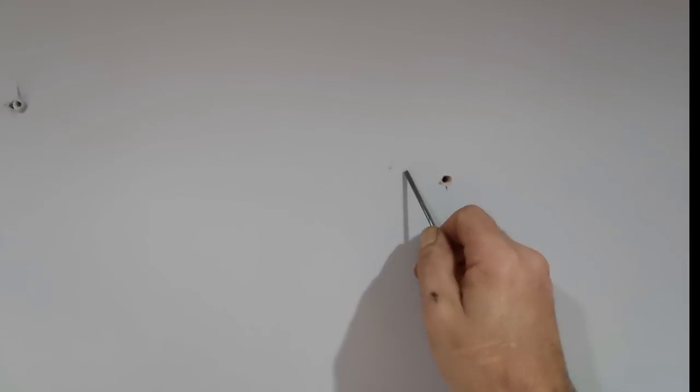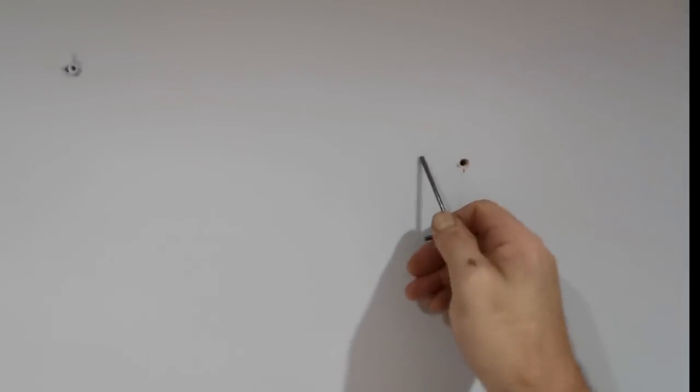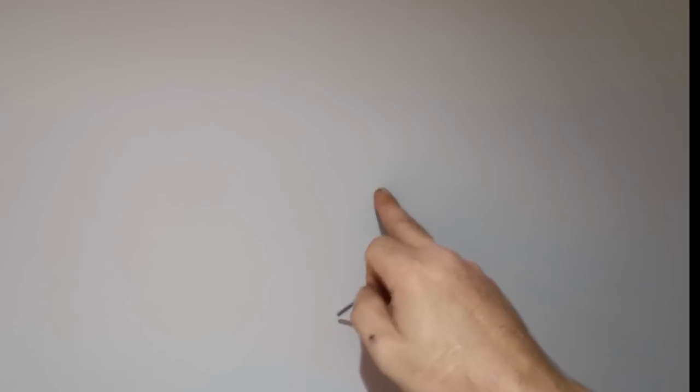So what I'll go is less than 2 inch either side. If you go more than 2 inch, you might miss the stud. We'll see. I only need 1, 2, 3. I only need 4, maybe another one in the middle.